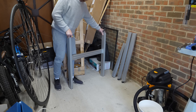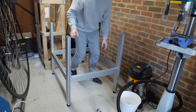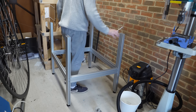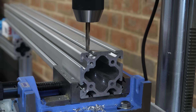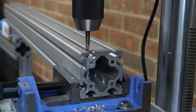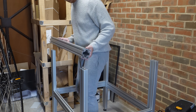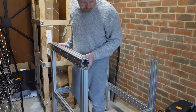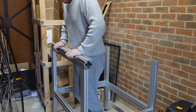It's basically like a large Meccano kit or an Ikea flat-pack furniture but all custom designed and probably slightly stronger than any Ikea furniture. The main beams for the actual CNC part of the machine are built from 8080 extrusions, which are really heavy duty, and means the machine will be nice and rigid. These simply slot onto the legs and they quite easily support my weight.